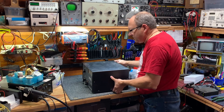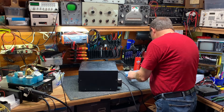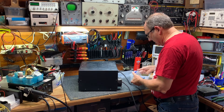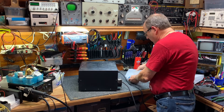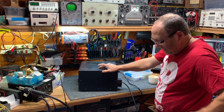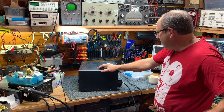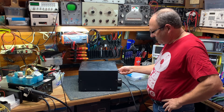So I'll replace these fuses with 12 amp ones. I don't have any 12 amp here — my stock goes from 10 to 15 amp. I'll order some 12 amp just to be absolutely sure nothing is going to get overloaded. But for testing purposes, the 15 amp is carrying it fine. Maybe we had a short in the antenna tuner, which is a possibility.